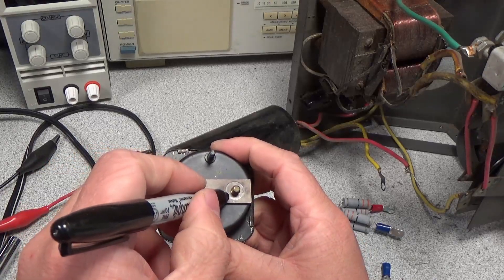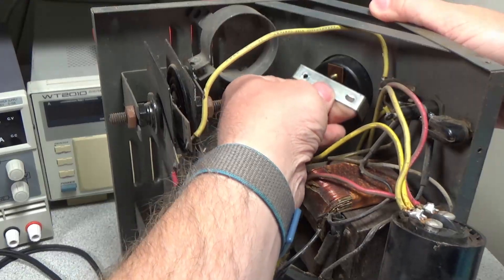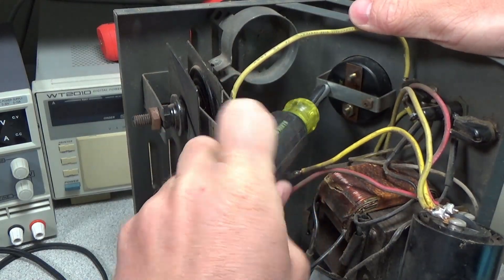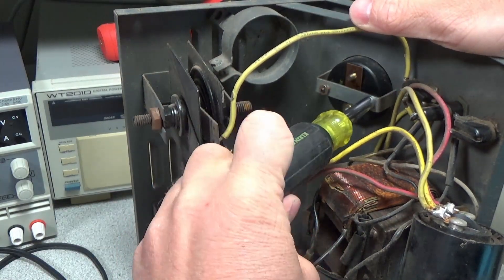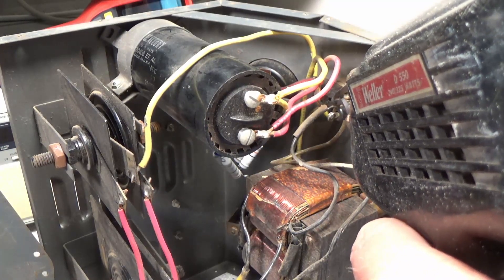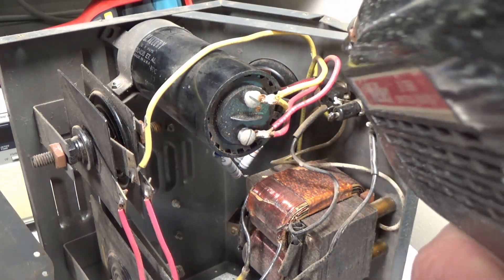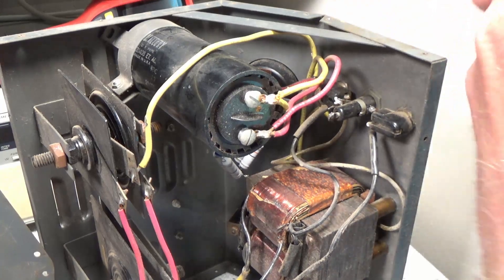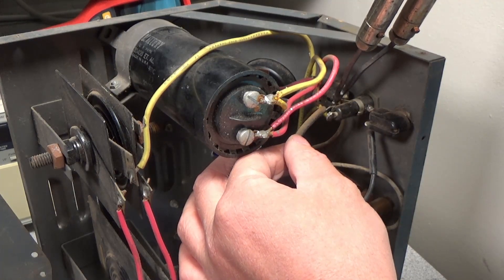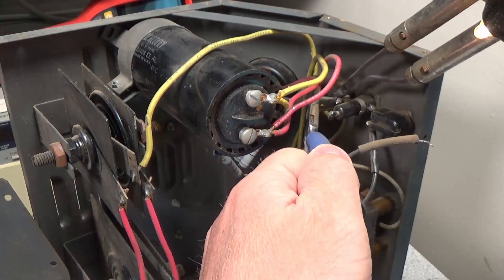Check that voltage meter before we put it back in the case. Of course you've got to label your meter — here you can see the plus and minus. We've got to put everything back together; there wasn't a lot of concern for space inside these units in terms of getting screws and bolts and nuts into easy-to-access places. One of the last things to do is rewire the incoming power. The transformer wire was wrapped around the fuse holder before it was soldered, so it's very difficult to remove — I ended up cutting the wire and then desoldering the remaining wire end.